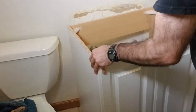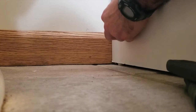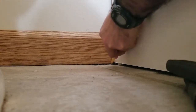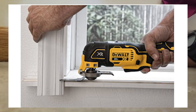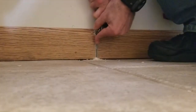With the old sink out of the way, slide the vanity into place and check for appearance and spacing. One difference is that the pedestal sink didn't go completely up against the wall at the bottom. Since the vanity does, I need to cut this trim so the vanity can actually go all the way up. This is solid in the back so I can't notch the vanity, so the easiest option is to mark it and cut the trim. The ideal tool would be a multi-tool with a reciprocating edge cutter, but since I don't have one, I'll use my trusty handsaw.